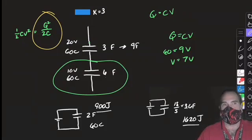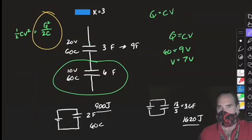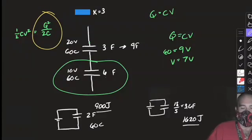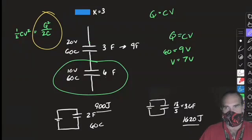Look, every single time we've done this, we've had a static circuit. And we've attempted to move the dielectric. What we're going to learn about later in the year is finding a way to move, I'll say the word dielectric, but it's a different word. Move our dielectric by changing our circuit. That's what we want. We had static circuits, right? The circuit wasn't changing while we attempted to move the dielectric in and out. What we would prefer is to be able to turn a circuit on and it moves out, maybe turn a circuit off and it comes back in. That's what we would prefer, something that we have a little bit more direct control over. That's going to require magnetic fields, and we'll get to those next semester.